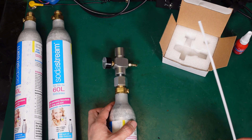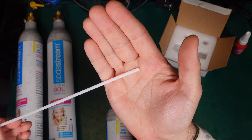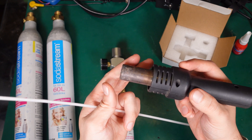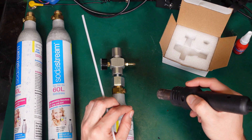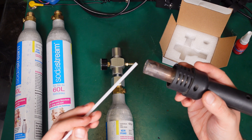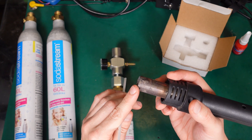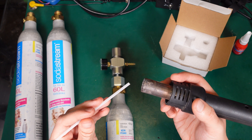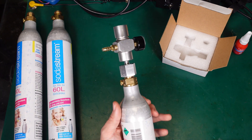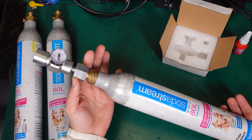I would like to do a couple of experiments, and one of them is welding plastic using plastic rods and a hot air gun. I was having a problem that while welding plastic that way it was extremely smoky and it was burning. My assumption is that if I use CO2 as a shielding gas, we are going to remove the oxygen and that should make it much nicer and cleaner. Thank you very much for watching, I hope you found that interesting — see you next time, bye bye!